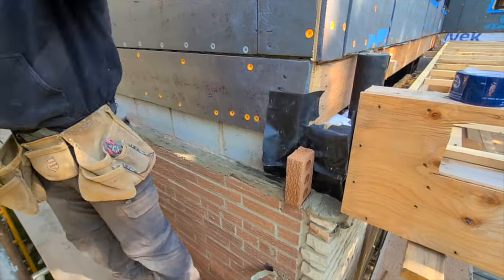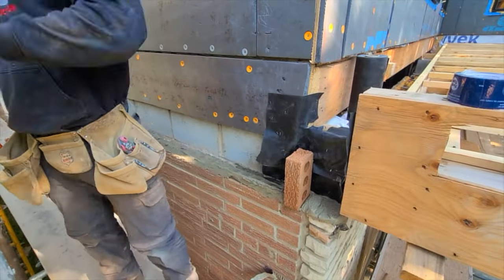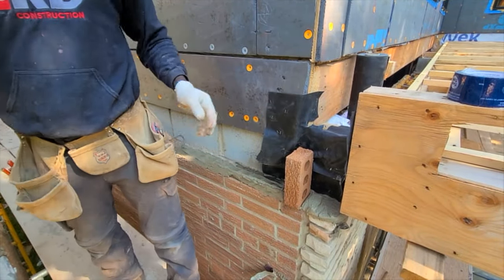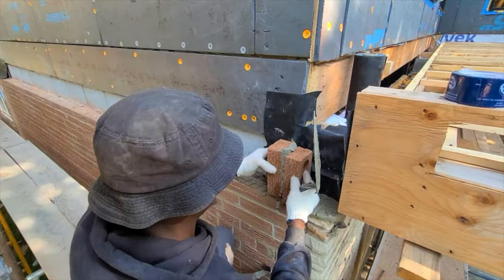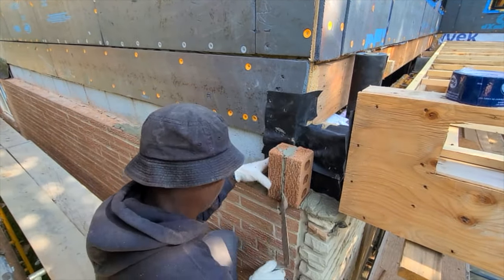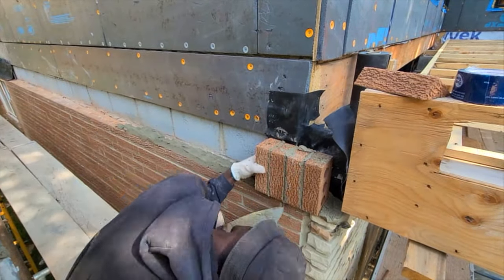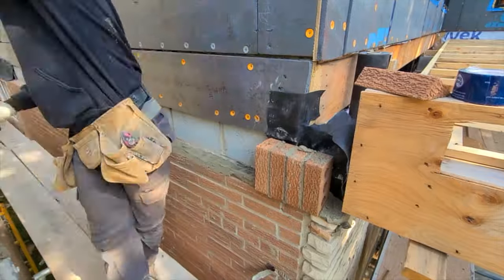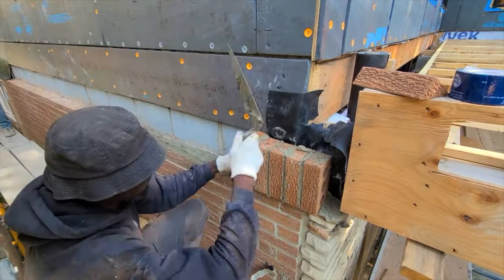But this one is huge. As you see right over here, the carpenter messed up the wall itself. If you see the block right beside me, the wall itself comes over around two inches, or maybe an inch and a half. So what I have to do here to help solve the problem is step my brick over around three quarters of an inch.